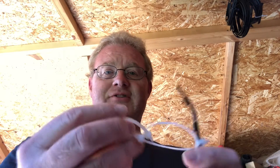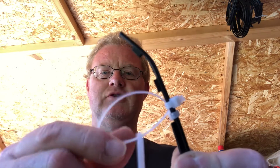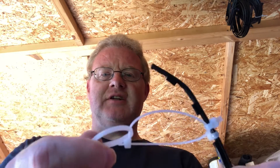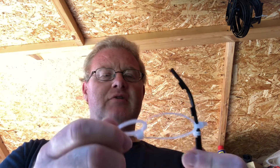Quick look at the insulator I'm going to use. You need to separate the radiating wire from the rope or string you're going to use to tie it off. What I've done on this one is put a zip tie here, cut it off completely, then put another one just above it. On that one I also looped in another cable tie, and that provides a link to the final one where the string gets tied off. Cable ties can be used as a short-term, temporary but quite effective means of keeping your antenna up. Won't win any prizes in terms of presentation, but it'll do the job for portable ops.